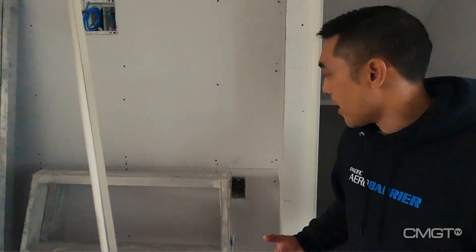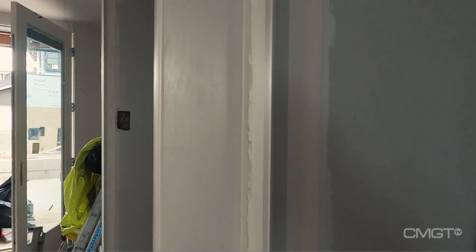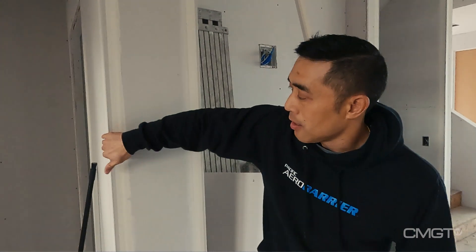Let's have a look. When the house is boarded together, you'll see edges like this — unfinished. Two pieces of board creating a butt edge. What you'll see in the end are beads, corner beads, all kinds of finishes that will cap off those edges, and this is eventually mudded nice and smooth.